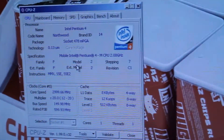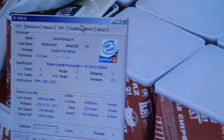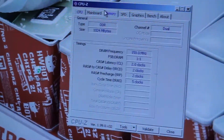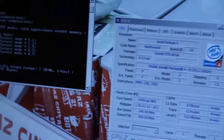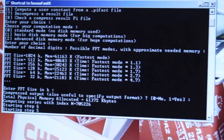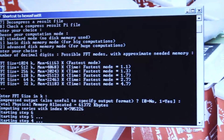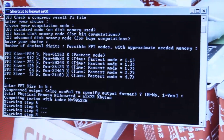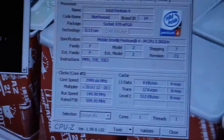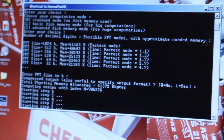Usually I just press spacebar to resume. Yeah, because I'm making a video now it doesn't work properly - that's basically what you have to expect. Now let's see - our memory is running at 150, exactly. I set it to 1-to-1 at 2-5 timings. I just want you to see that this is basically really running at 3 GHz and not just bugging out in CPU-Z. I obviously did more testing than that - I took the fastest Cinebench Northwood scores on another chip, and I think fastest wPrime as well. It truly is running at 3 GHz.